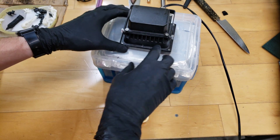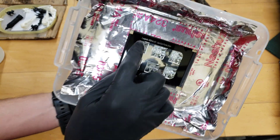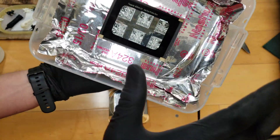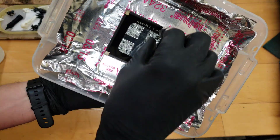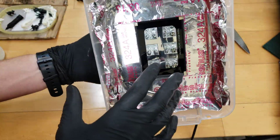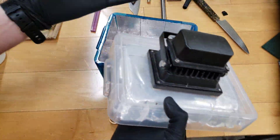The first step I did was cut a hole in the lid and attach this 20-watt 405-nanometer UV LED. I purchased it from Polyformer and it's a 405-nanometer LED — you can use any 405-nanometer LED you find. It just has to be about 405 nanometers to do the proper curing. I purchased from them because I trusted that the UV LEDs they were sourcing were of good quality, but this is a fairly generic housing for a 20-watt LED.